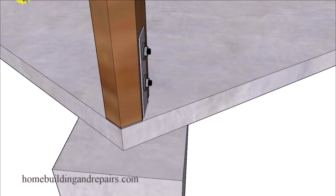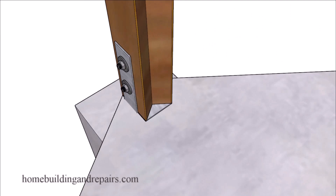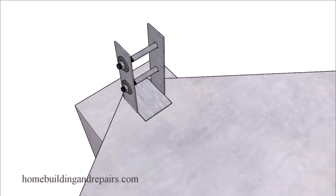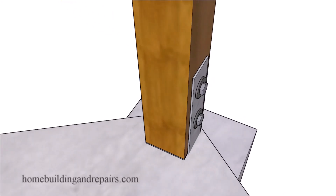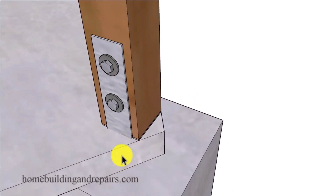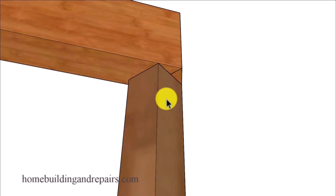I shaped the outside and the inside, however you might just choose to shape the outside or the inside or neither - whatever is going to work better for your project. I like to make sure that my post base connectors are off the ground a little bit, so that the bottom of the post base connector sits on top of the concrete, providing about a quarter inch distance between the top of the concrete and the bottom of the wood post. You could always make the slab a little larger for a stronger footing connection by extending the width of the pentagon at the bottom.